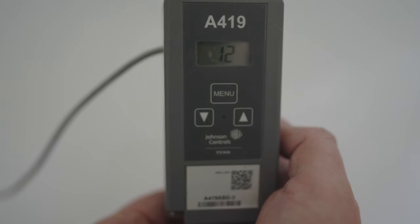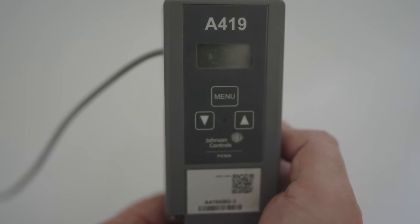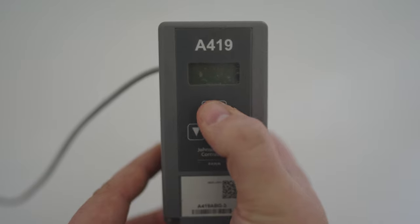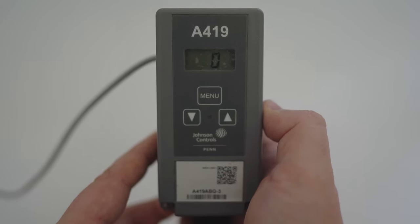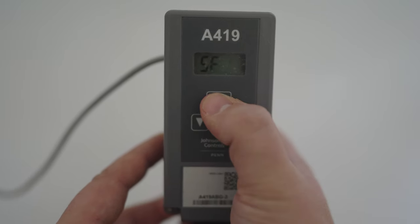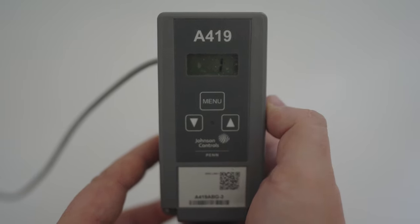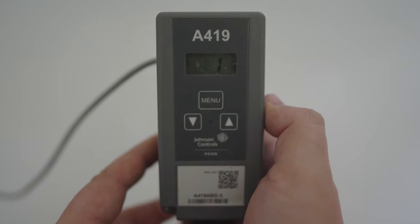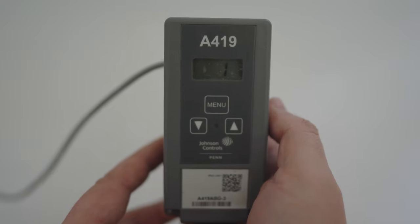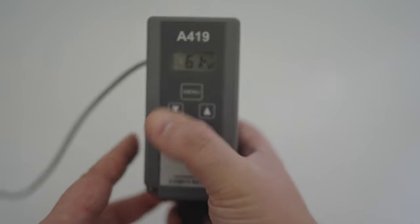I have my ASD maxed out in order to ensure that my compressor doesn't burn out too quickly. For the last two settings, I actually leave everything at default. OFS stands for offset, and is used if you would need a secondary setpoint, which is something that I have never needed. The last setting is SF, or sensor failure operation. I leave mine set to 1, which means the controller will implement a 1 minute delay before initiating failure response. This is primarily used in industrial applications to allow maintenance personnel to verify what the failure is before annoying failure indicators go off, but this doesn't really apply to this fermentation chamber setup.